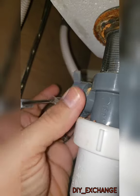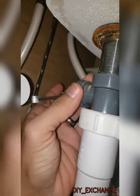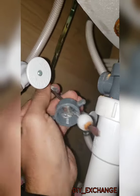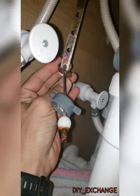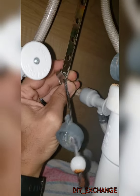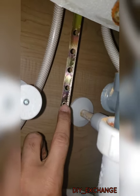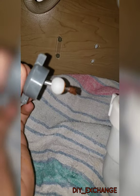So we're going to go ahead and twist this open - a little water going on, shouldn't be much. Then you pull this out - you see there's a ball - pull this out. It's being secured with this fastener, so you want to squeeze this just a little bit and drive the rod out. Remember the spot where the fastener was at so that you have the right alignment.